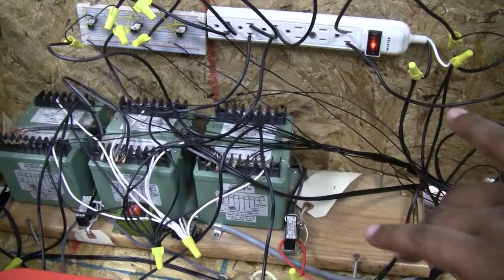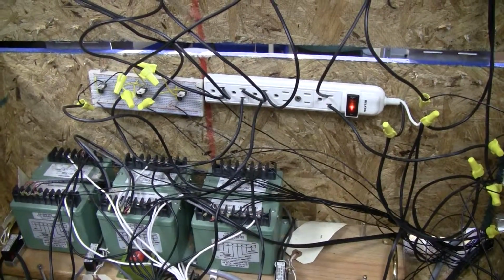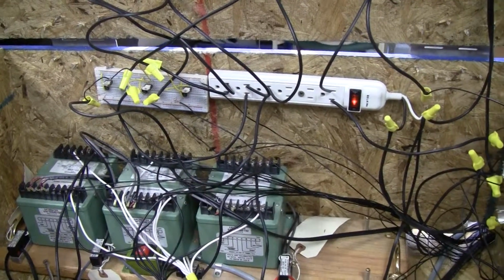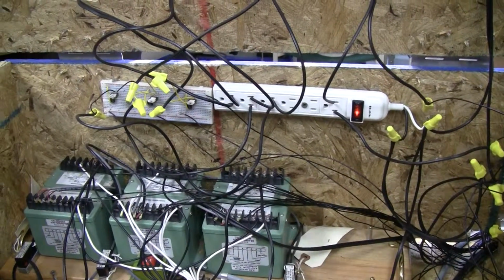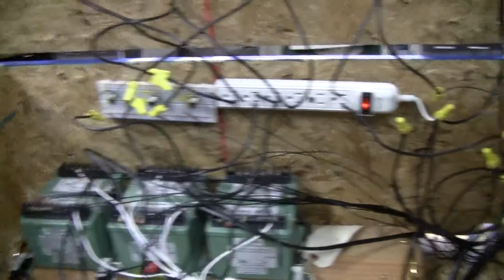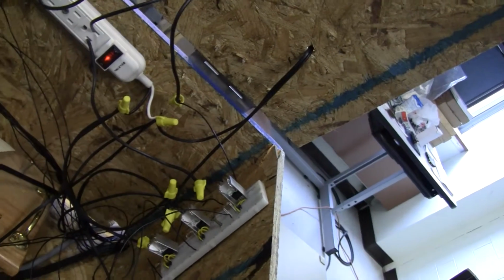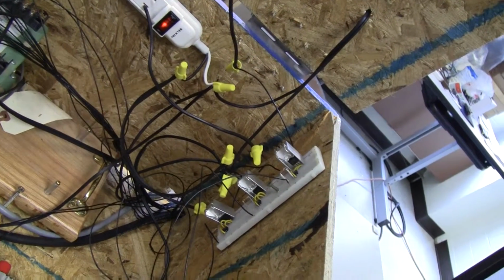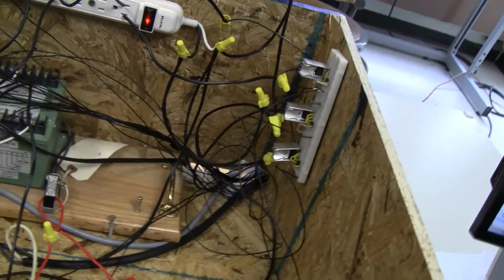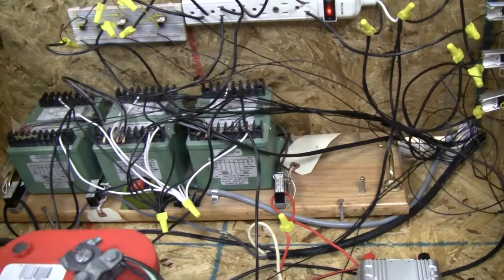And on the AC switching, we use triacs because they have bi-directional current. So it allows us to switch AC loads on or off. We have to send 5 volts, but we actually use an opto-isolator circuit. It's really hard to see, but that basically allows the very expensive driver equipment not to be damaged in the case of a short or what have you.